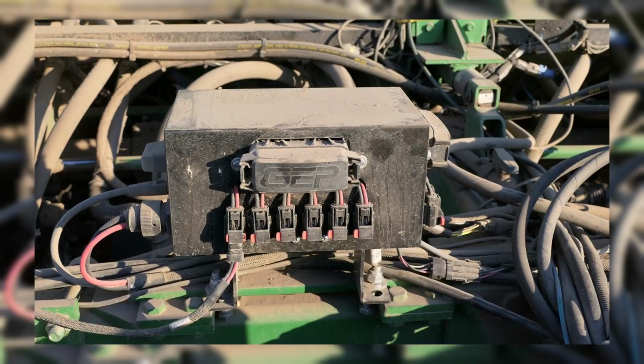I guess maybe this doesn't pertain so much to the drill, but in our system, GPS is a huge advantage, both corn planter and drill, and row cleaner. And you added active downforce to the drill lately, so I think it's going to increase the lifetime of a lot of the wear parts on it. Prior to the active downforce, we did have adjustable from the cab, which I would call a must-have. You get to those hard headlands, or clay knolls or whatever, you can at least increase the pressure from the cab, not have that extreme pressure the whole field that way.